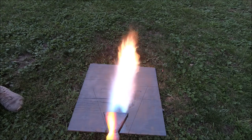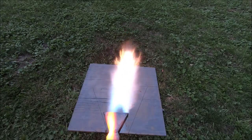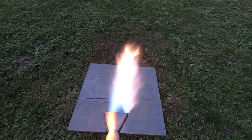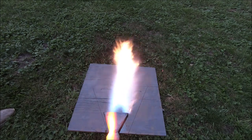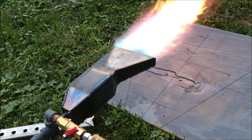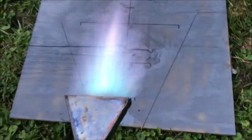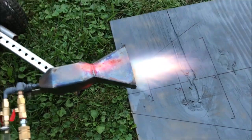It's also good to run these burners on a very lean, hot burn when you're done with them for the day — just for a couple of seconds — to burn out any carbon. That can be done by reducing the fuel to the point the flame almost goes out but maintaining maximum air. That will make the combustion chamber glow red hot and burn off any unburnt fuel that has accumulated, residual carbon, and things that might be found in waste oil, french fry crumbs, or motor oil particles. When I describe a lean burn, I'm going to turn down the fuel while leaving the air the same — that causes a super-hot, oxygen-rich flame. See how the combustion chamber is already starting to turn red hot as a result of that adjustment.